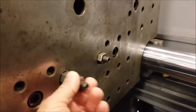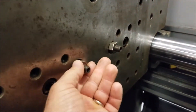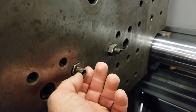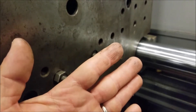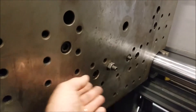Right here, these are what they call ejector rods. These tie right into the ejectors in the mold, and this is what pops the plastic part out when the mold opens up and the robot is ready to come down and grab it.